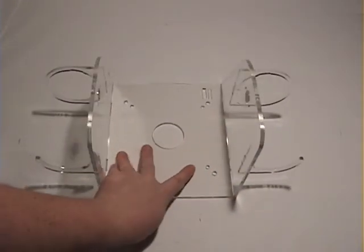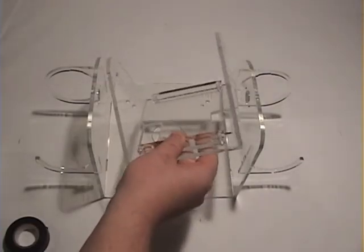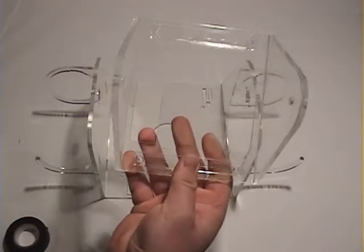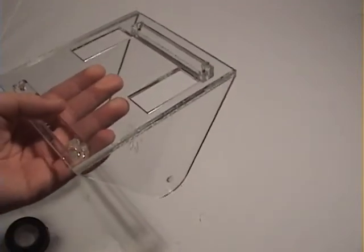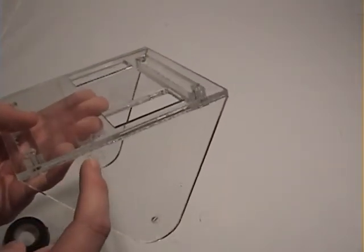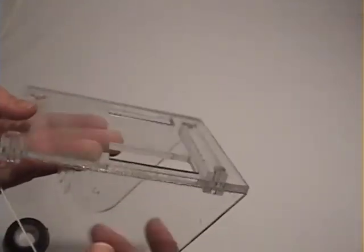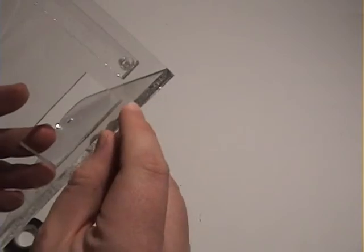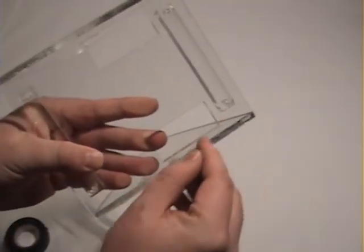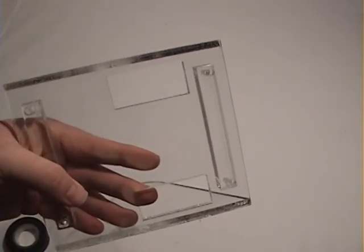So now we need to have the inner cradle. This is what actually holds the paintball gun. That's this guy right here. Check that out. Important little hint about this. So here's kind of a close look. I've built this now using some Tippmann A5s, and I've built this also with the Ions. When I use the A5s, it seems to be a heavier gun, maybe a little more front-loaded, weight-wise. And so what I've had happen is this seam will separate. Well, the nice thing is, if you drill 3 holes, 1, 2, 3, and sink a screw in there so your screw penetrates, piece of cake, holds itself together no problem.